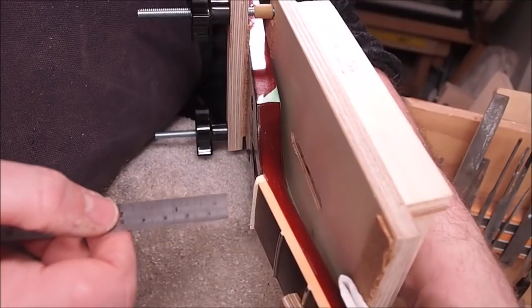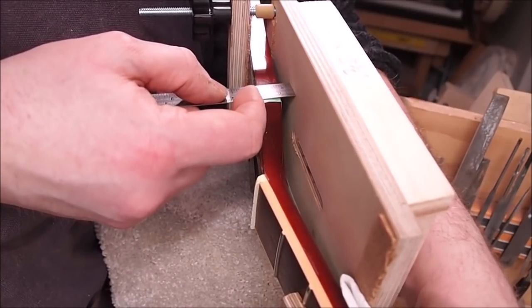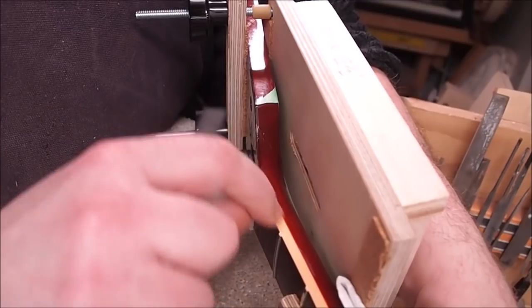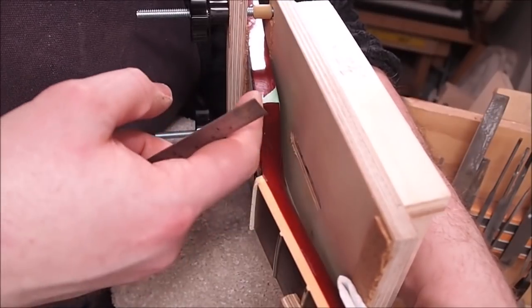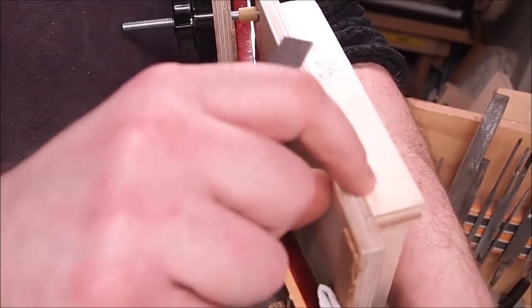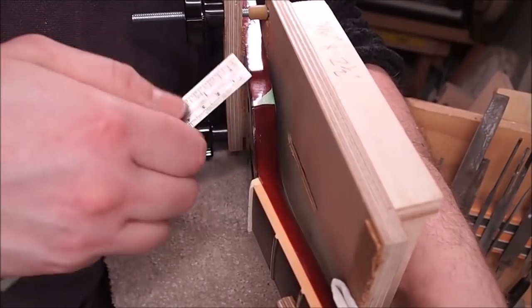How do I figure out the full depth of slot? I've marked out the approximate length of the slot and I can measure down from the underside of the jig to the full depth of slot. On a Les Paul here, it's usually around 22 millimeters on this jig. 22 millimeters will give us a couple of extra millimeters below the surface of the fretboard and also the headstock facing - so I'm not in danger of routing through the front surface of the headstock. I take that measurement of 22 millimeters and add on the full depth of the bottom of the jig, which is 11 millimeters, gives us 33. So my router bit is going to have to project 33 millimeters below the surface of its base plate.